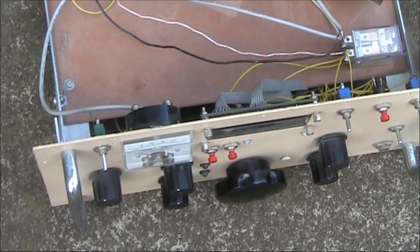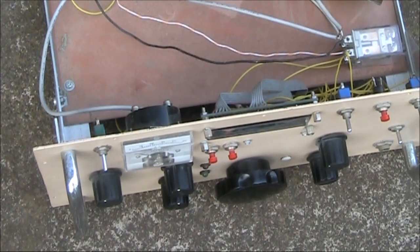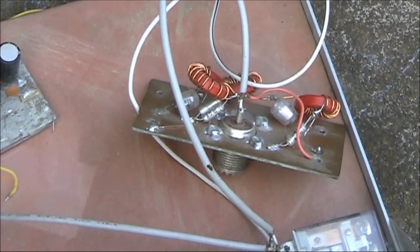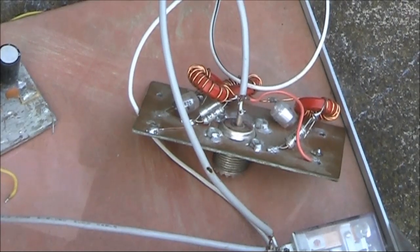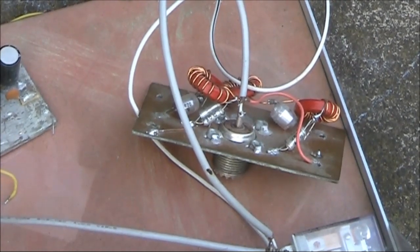This is fairly primitive and you'll need to change two settings to change bands: the VFO, which is made easy because there are ten tunable memory positions that I can have preset for each band, and the rotary knob that selects the various filter options between 160, 80, and 40 metres. Also makeshift on the back of the antenna socket is a low pass filter for 80 metres, but I've taken that out of circuit for now and am using an external filter which switches between 40 and 80 metres for my receiving tests.